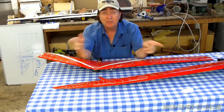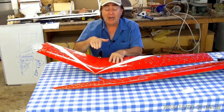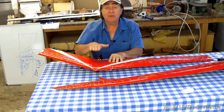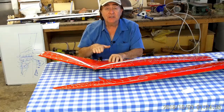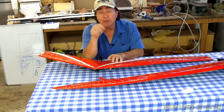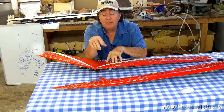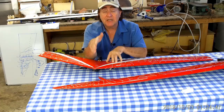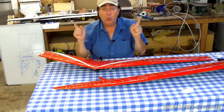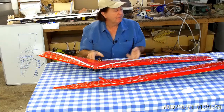What you can do is make them a little larger to make up for the smaller moment arm, and also move them further aft. Moving them further aft helps restore some of that moment arm and control effectiveness. Those two small changes will not increase drag very much, and you gain back the effectiveness of stopping the spanwise flow. First lesson out of all these videos: winglets inboard.